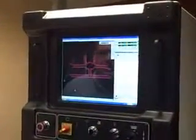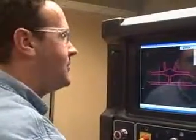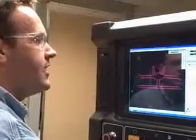I'm going to go ahead and click OK here, but we also need to be sure that we have a perfect point of where our nozzle is in the lower left corner of the material that we're going to be cutting. And now I'm going to go ahead and use a special home that I have, known as F-22 Raptor home in this case, which I created earlier, and I'm going to zero that out.